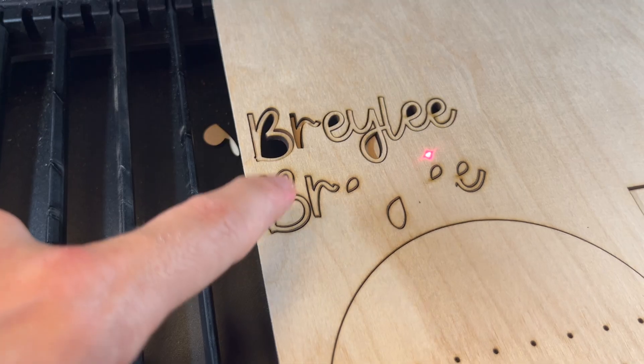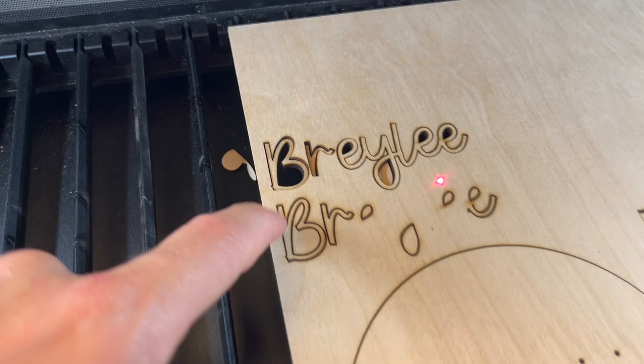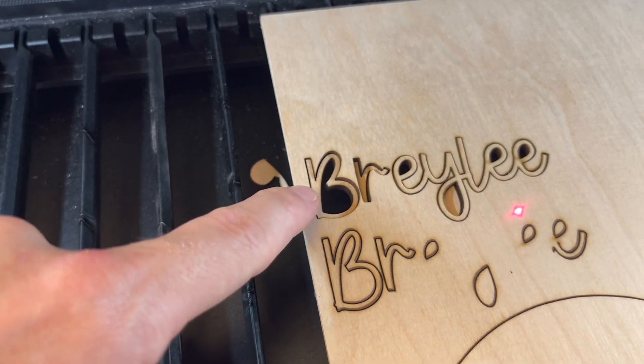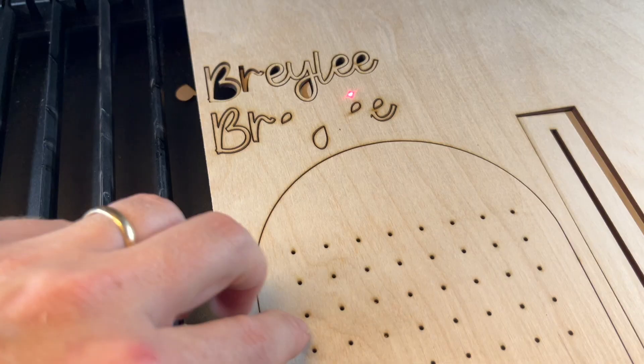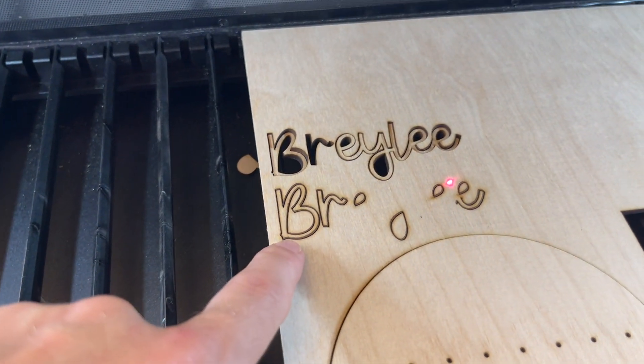You've got to test it after you calibrate. I ran the exact same engraving — this was before fixing the optical path at 40% power and 16% speed. This is after, also 40% power and 16% speed — so it's identical, except the laser actually does its job when you calibrate it right.